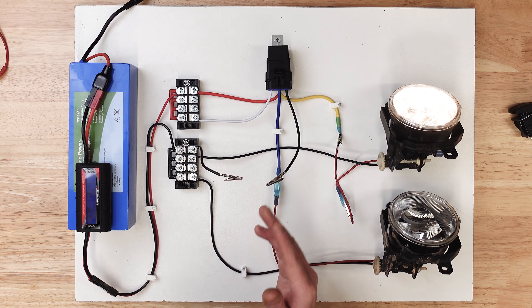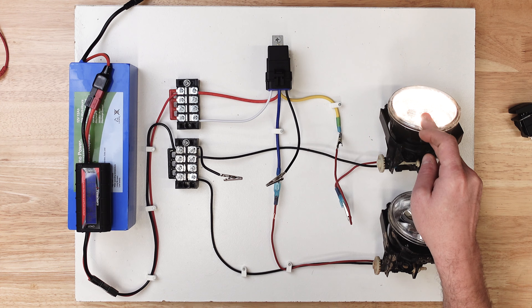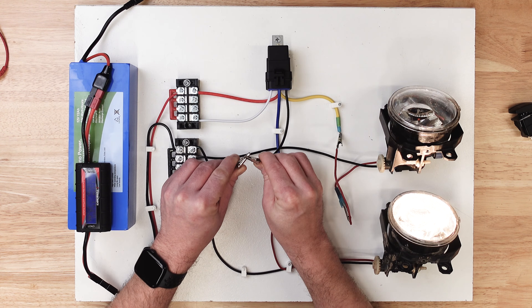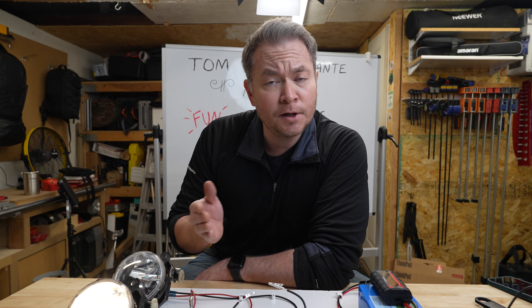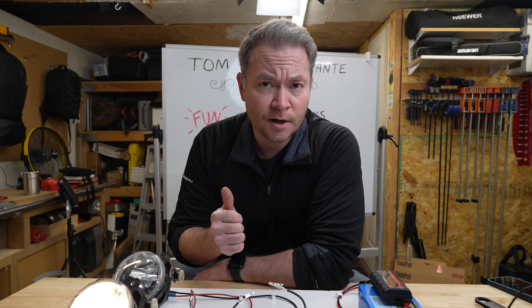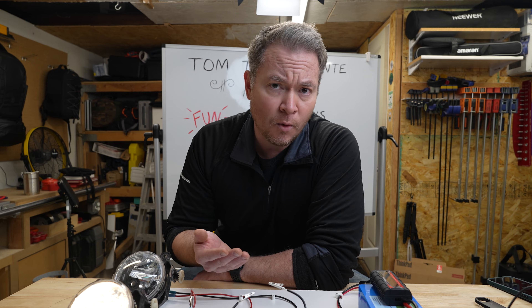So what should happen when I throw this switch and energize the relay? We should see power cease coming through the yellow and begin going through the blue. In other words, this light's going to turn off and this one will turn on. With one relay, you can choose how to power your devices — either in the normally closed position where power goes to your load unless you turn the relay on, or to another load where it only receives power when the relay is energized, or connected to the normally open position.